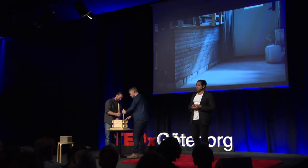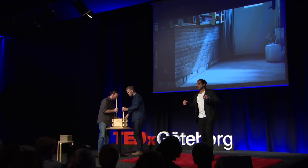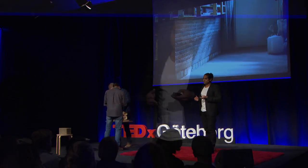Now, I know what you might be thinking — okay, this is not Mexico, that's only good for southern climates. But the truth is, it also works in cold climates, and we are actually testing this. This is a wall we are helping to build inside a straw bale house here in Sweden. The wall is oriented towards the south, so during the winter the sun heats the wall, warms it up, and during the night it will release the heat, so the house will need less energy to stay warm. Rammed earth walls also help to create a healthy indoor environment as they do not release any chemicals. They also regulate humidity, because they take up and release moisture throughout the day.